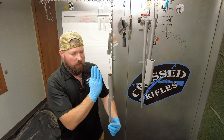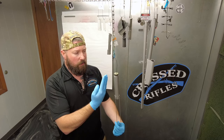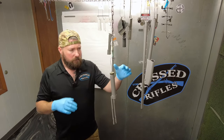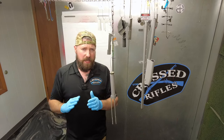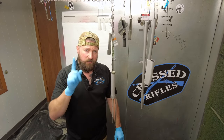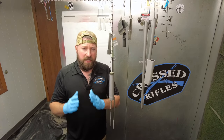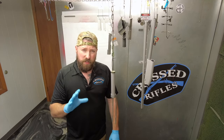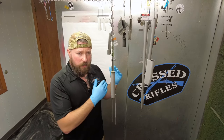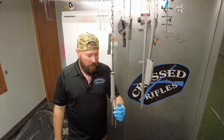What I mean by eight-sided is we're going to start on one side, find a reference point, and spray evenly eight times all the way around — typically turning the product, not our hand. We'll do this twice around to make sure we're laying down a good even coat of Cerakote, wet not dry. We do that by adjusting to one full turn from closed on the fan and two full turns from closed on the material knob. Before we spray anything, we jump on a white piece of paper to make sure the material is laying down exactly like we want — that's imperative.